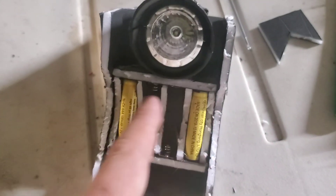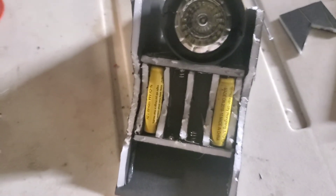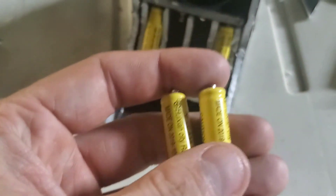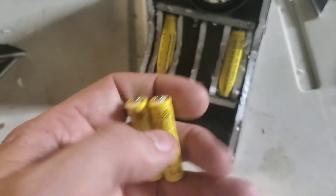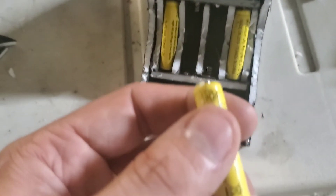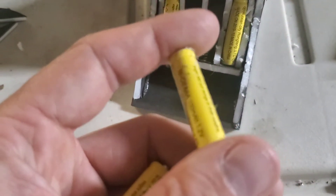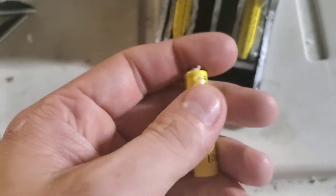Run over to this device, pull the dead batteries out, and stick them in the charging slots accordingly, and stick this little boy in the sun. It'll take about 10 hours to charge completely in direct sunlight. The other batteries should hopefully last you until the new ones are charged. Once you pull these out of the device and put the newly charged batteries in, don't stick these into the charge slots — you're going to want to stick these into the storage slots. These are old NiCAD-style batteries, and they're not like lithium-ion. You can't charge them and discharge them however you like — it damages them. So if you want these to last as long as possible, you want to store them while they're discharged, and recharge them once a year or so.